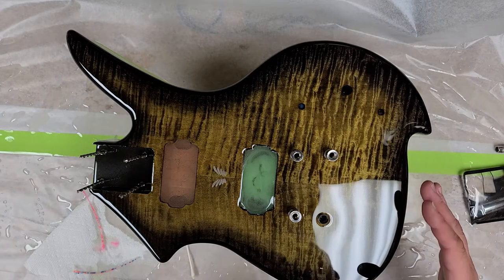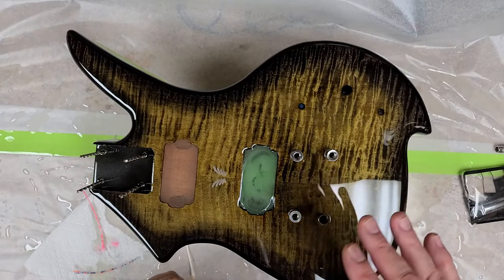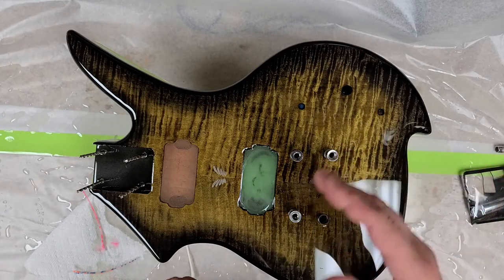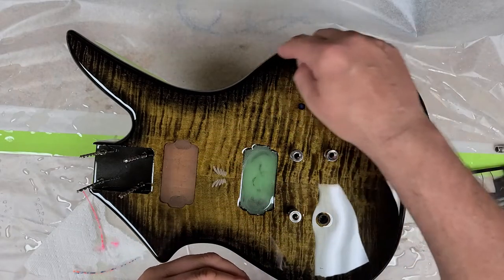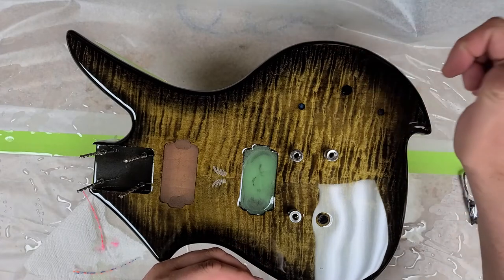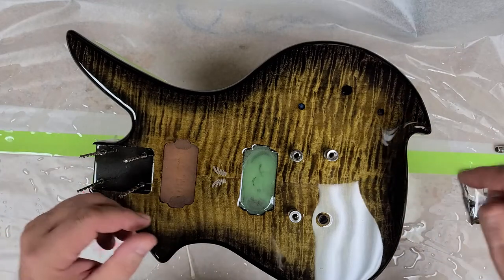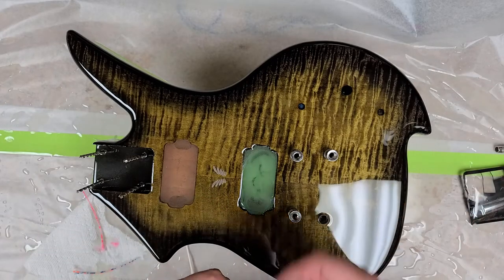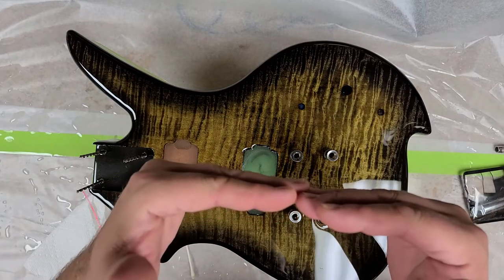So the back of this thing has been sanded down, and it's been level sanded. So what I've got to do is put another coat of epoxy on this after I remove this tape. Now, when I say getting a nice seam, that tape line that's going to be around the edge is going to get tape going this direction now, instead of down, and this will be flipped over. So my drip skirt will be facing down again, just exposing that little line that the tape made from pouring the top. That's going to give me a nice bond when the two meet each other.